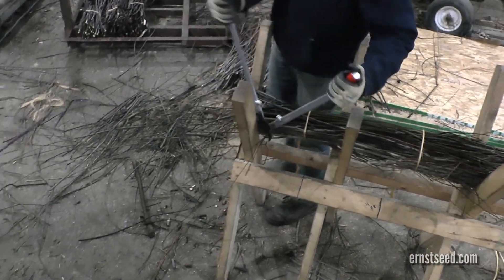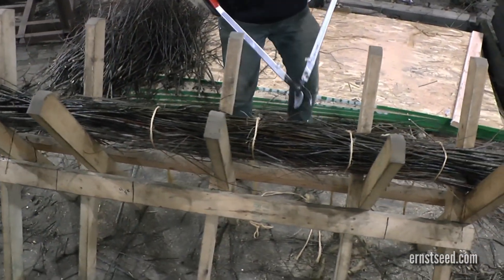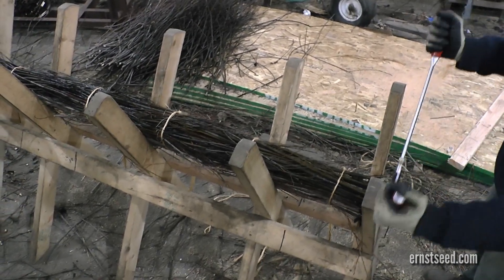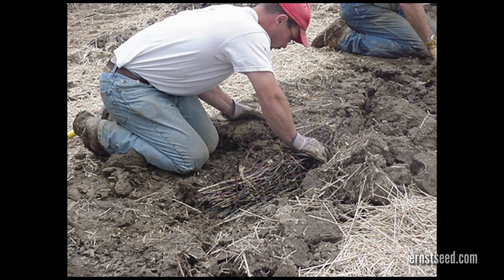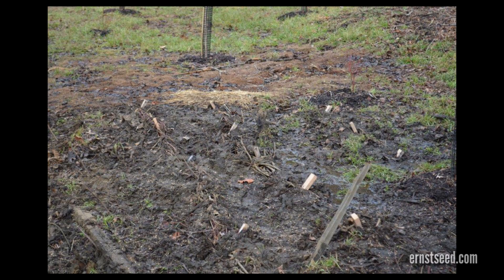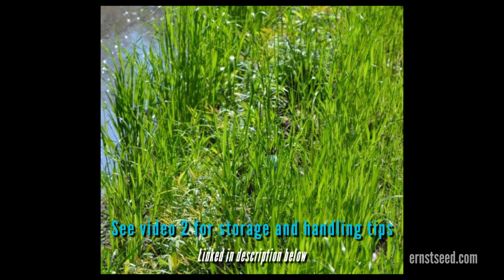Within one growing season, roots and shoots grow along the entire length of the structure, quickly stabilizing the bank. We recommend six to eight foot lengths for ease of handling. Wattles are available in four to eight inch or eight to twelve inch diameters; custom lengths and diameters can also be ordered. The material is placed in six-inch-wide trenches on banks or slopes parallel to the stream contour and partially covered with soil. Wedge-like dead stakes secure them in place one foot from each end. Live stakes can also be used in conjunction with dead stakes. Overseeding with an appropriate seed mix and straw mulching the site after installation help retain soil moisture and reduce surface erosion.